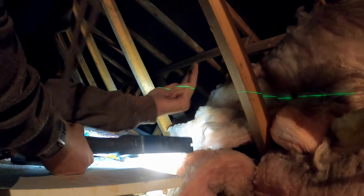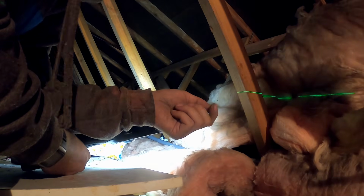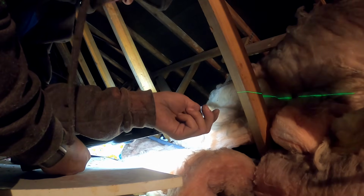He's doing all the chasings for me, so he's starting that end so we can start to get some drops to put down. What we'll do is we'll put pulled bends to get it out the eaves, and then just get them protected in the wall with some hair felt, clip it down in 15mm and get it sorted. If I can get all this end done today, I'll be fairly happy, but you know, just see how it goes, just keep plodding on.